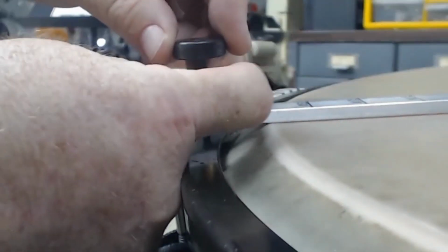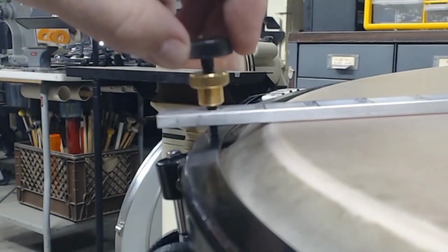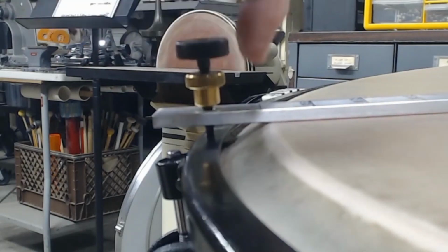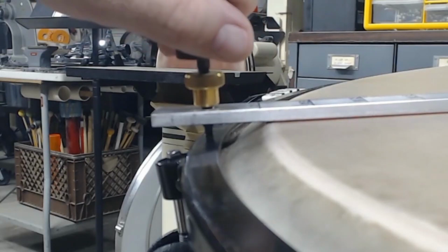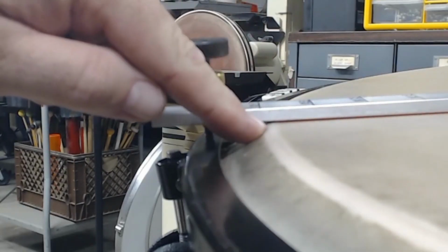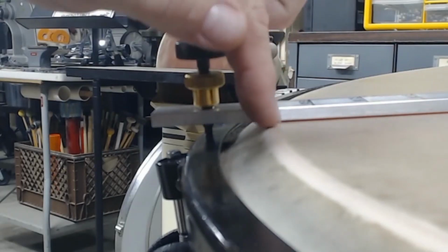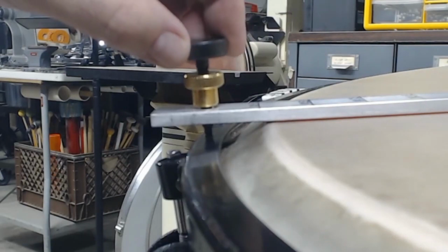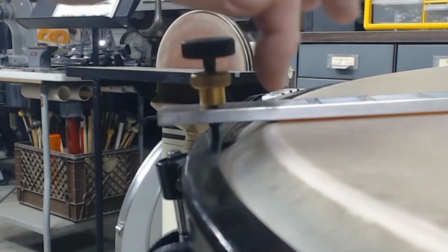Give myself a little bit more there, to where it just touches. And you might be able to see over here, I'll run it a little high for you, it lifts off the lip of the bowl. So that's how the jig really works: it uses the two corresponding lips of the bowl to give you a true level. So you can see the height there.